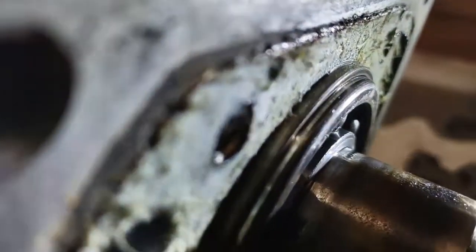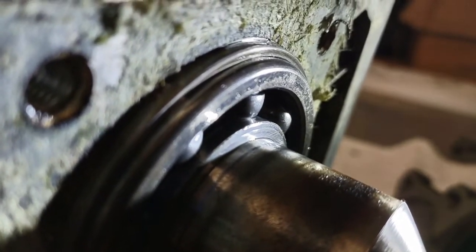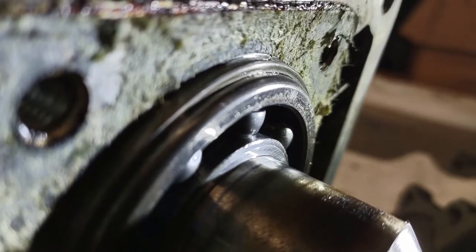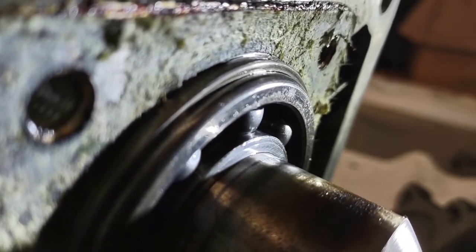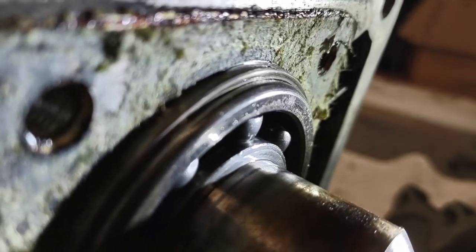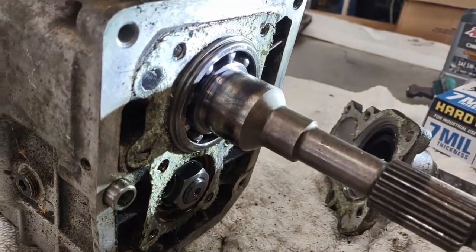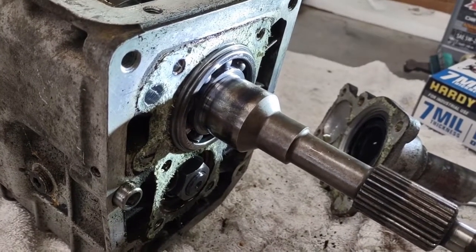There's additional play right here. You can see the little bubbles right up top here. I don't think there should be that much play between the bearing and its locating ring. I think that's been some of the problem — that accounts for a lot of the vibration issues.